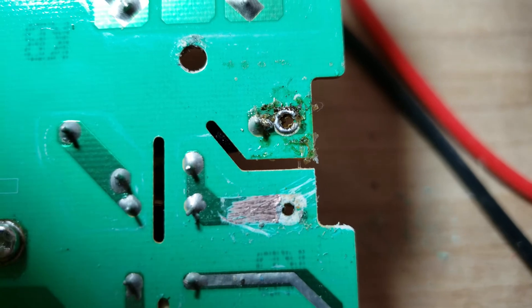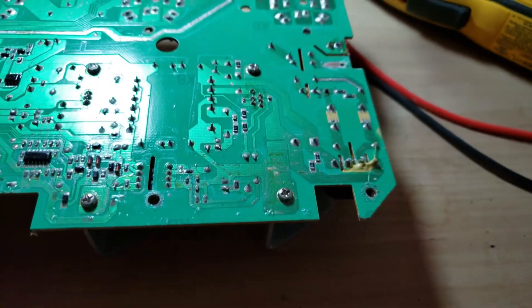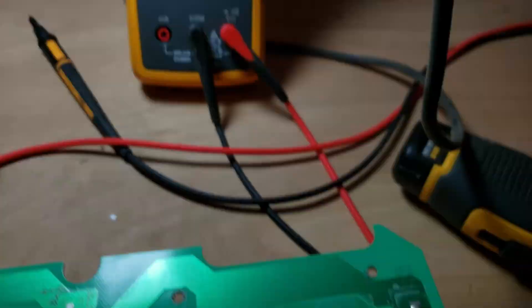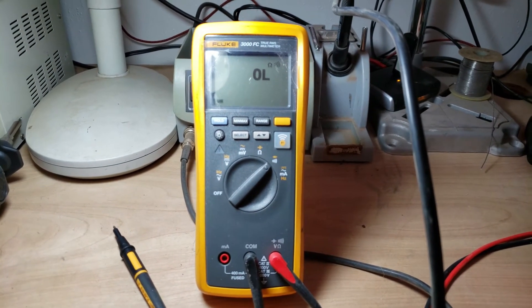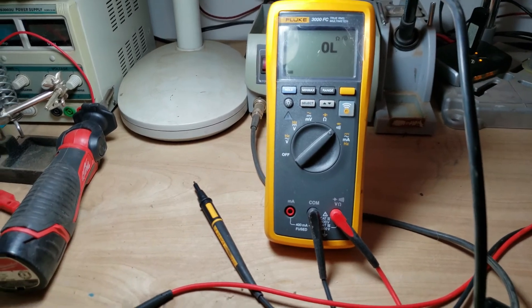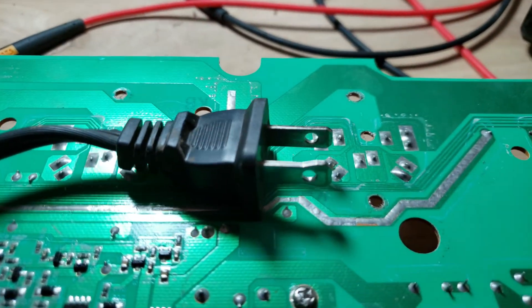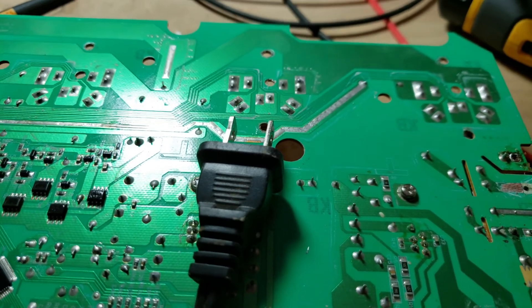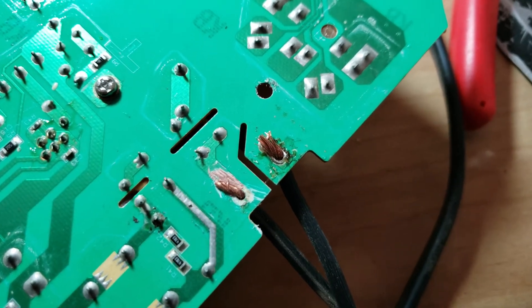With the board out, I've already sorted the wires. Next, run a continuity test on the cable directly with a multimeter or ohmmeter — test from the plug-in end to the tip on each side, to make sure there is continuity.